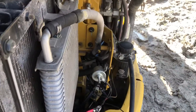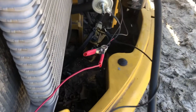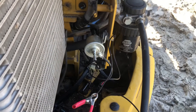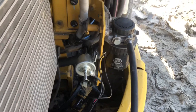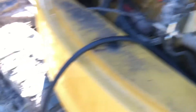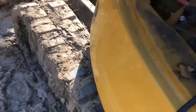I've got another little electrical pump off my truck. I know it looks kind of hood, but I had to use some jumper wires off the plug. I bypassed the little PD pump that comes from the factory - I know it's bad. I went directly on the output side of the filter, ran a hose around to the suction of my pump, and there's my discharge hose. This is going to run up here and tie in right here.